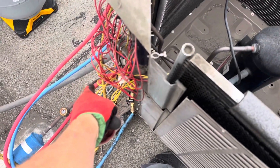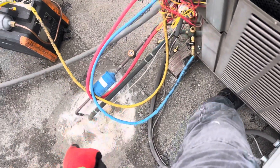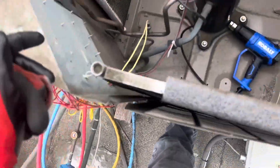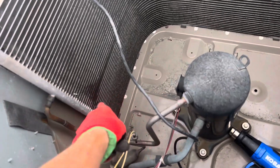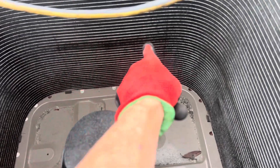I did mention before they used half-inch liquid line on this, not three-eighths. They necked it down to three-eighths right there, but he has half-inch going back. I guess he wanted to sell a lot of extra refrigerant to make money, and sell a lot of extra copper pipe at a higher price to milk the customer.